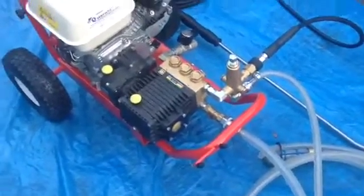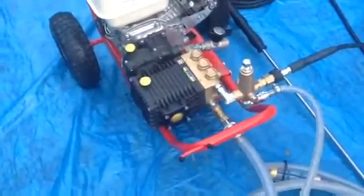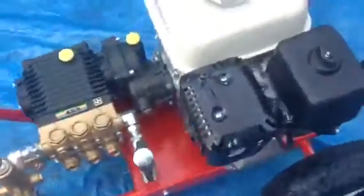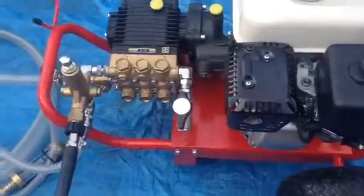So if you've got a leak on the gun, it will not make the machine surge. Prime and frost valve — so as we prime it up, it means we're not going to get a back pull and have to keep releasing the trigger to get it started.